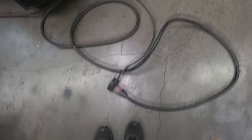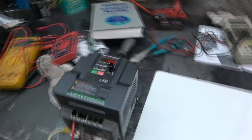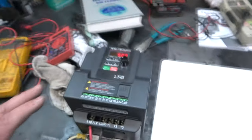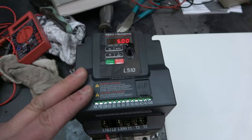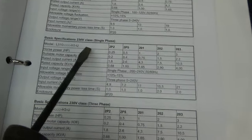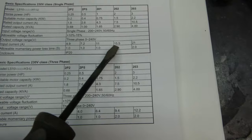I like to play around with stuff. I made a temporary cord to this so I can set the parameters, and I'm going to temporarily hook it up just to run the machine — power it on and off with the breaker. That's what I'm going to do for the final product: when I'm using the mill I'm just going to turn the breaker on and power up the inverter. This 202 is calling for an input current of 15.5 amps.